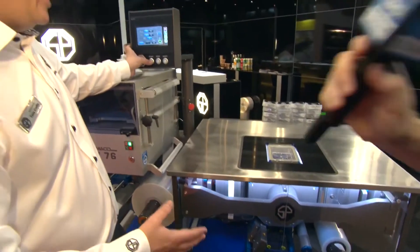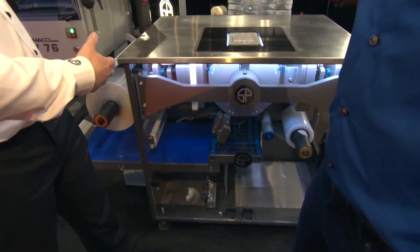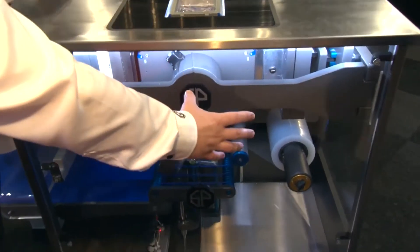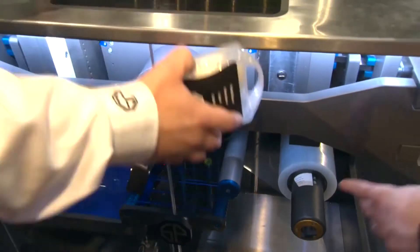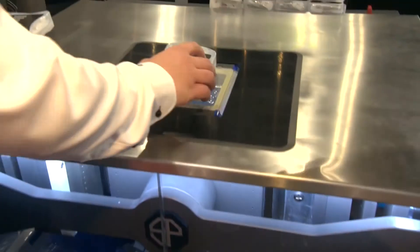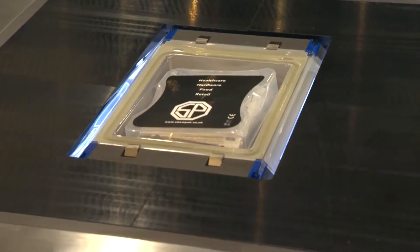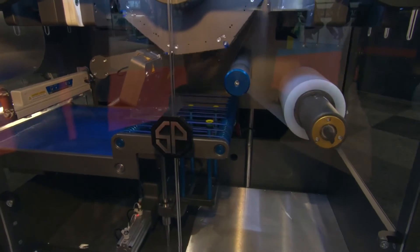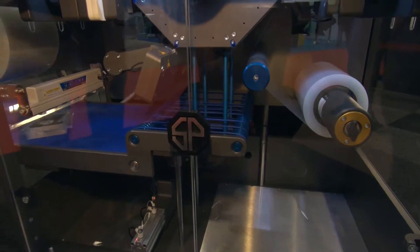Are we going to see it in action? We can see the machine in action. I'll just do some loading of the machine and then you can see how it works. So the forming of the film is on the side there — it starts off on a drum, thermoformed, makes the containers there. Then the filling is on the top, and as the drum rotates we come to the sealing area which seals the top film onto the pack, and then a positive take-off and gentle handling onto the takeaway conveyor with the finished pack. And there we go, there's the finished pack.